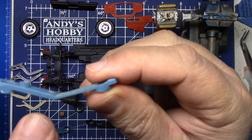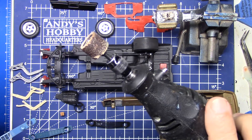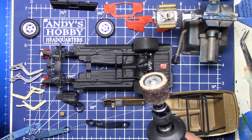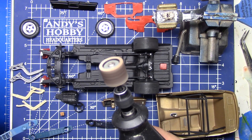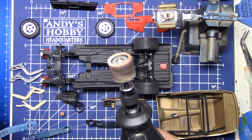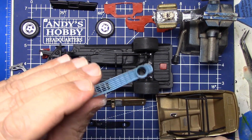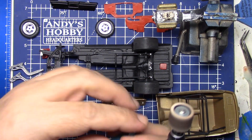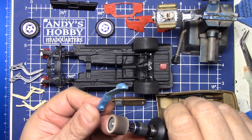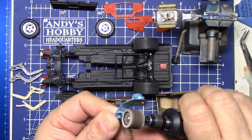I just take out the middle, and you can see it really shows the difference. This is something I wanted to show you. I use my Dremel tool with a barrel sander, and I have a speed control. I used to have a foot control, which was always nice because you control your speed with your foot. When you turn these things on they want to go fast, but you can get this thing down really low and calm — you just kind of get in there and slowly work it at whatever pace you want to go. The trick is you just have to take your time. Let's see if we can get a portion of this ground out for you.